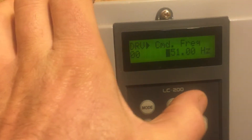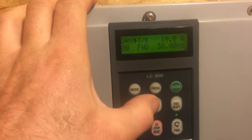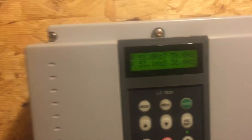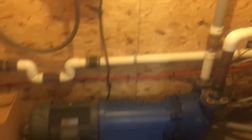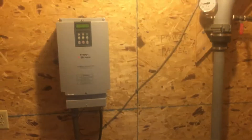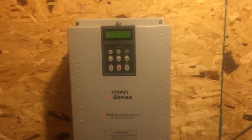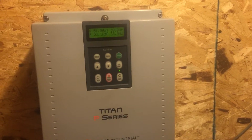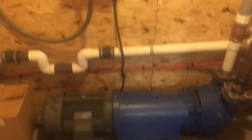You shift it over, change the set point, hit enter and it goes back to that screen. This is an older unit — the newer ones are just a hair different. If you get a chance to run a three-phase pump with a transducer, or you're thinking about it, it is definitely an awesome tool. This machine coupled with our vacuum sensing system in the woods is just awesome because we have so much knowledge about what's going on. The vacuum sensors give us direction, but this gives us the overall picture of what's happening out in the woods.